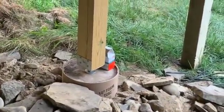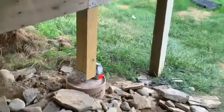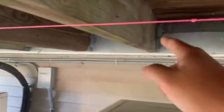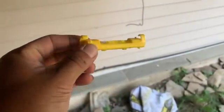Basically what I want to do is take a lot of the load off the house. I'm going to construct everything the same way as I did with those posts over there, using the Simpson tie - the adjustable one. If I were to set it into concrete, it's not going to have any load on it because the deck wasn't raised and it's so close to the house that I didn't think it was possible to do that.